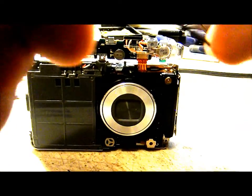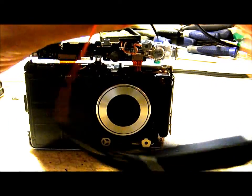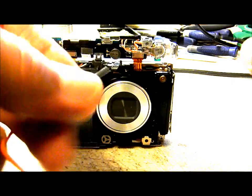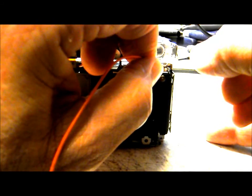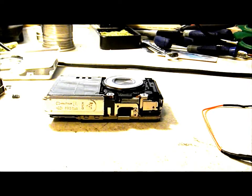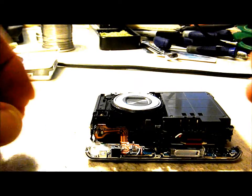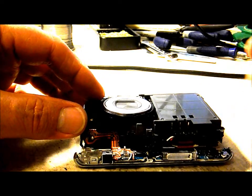I'm going to get my trusty resistor and see if I can get in here and discharge that capacitor without burning anything up. The camera's going to fall over so I'll do that off camera and come back. Now that I've got the capacitor discharged, we know we're not going to ruin our board.